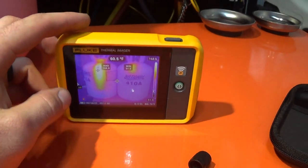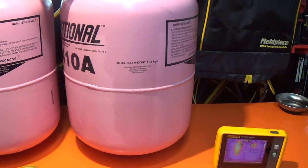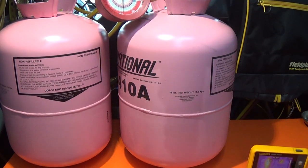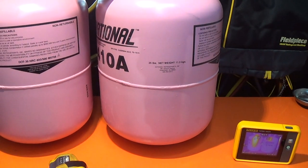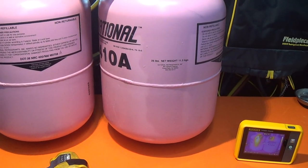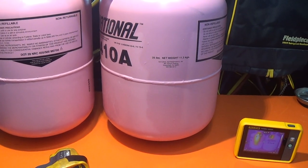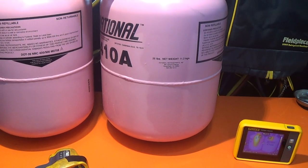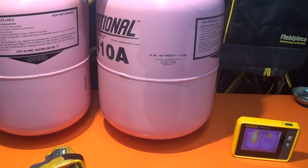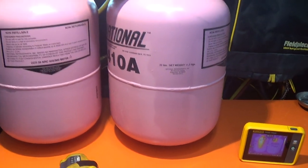Now theoretically you could use this for propane — of course you have to be careful doing that, and maybe boiling water would be a good substitute. But this can be used in refrigeration too. Once you install a system and your charge is correct, have the system pump down and mark the level of liquid on the receiver. That way if you're low, you can pump down the system, look where the liquid is, do a calculation of the volume of liquid you need, and then add that amount back in by weight.